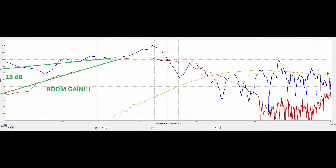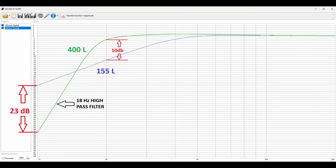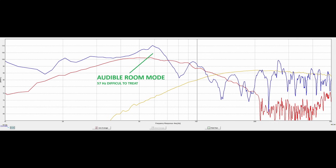The next thing I want to look at is the room gain — this is what I love about sealed subwoofers. They're not just easier to build and smaller; they also give you a ton of low-frequency extension. You can see down below 20 Hz I'm getting tons of room gain — 5, 10, 15, even 20 decibels perhaps — and I'm not even showing the graph below 10 Hz. A ported subwoofer would have to shut things down at usually about 20 Hz with a high-pass filter to stop over-excursion of the cone, which would really drop off the output. The last thing is that 60 Hz peak. Some parametric EQ can pull this down using a DSP, which I plan on doing. I can hear it and it sounds awful, but it's not a fault of the subwoofer — it is a fault of the room. I can't fix this with room treatment; I have to use DSP.